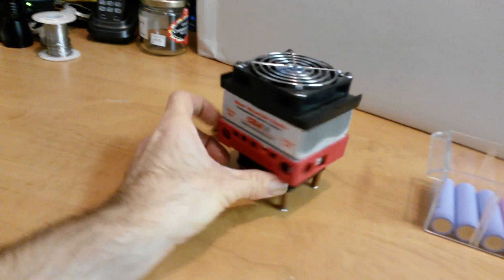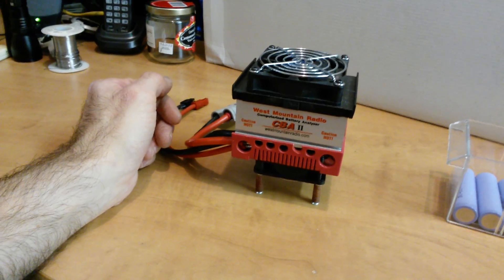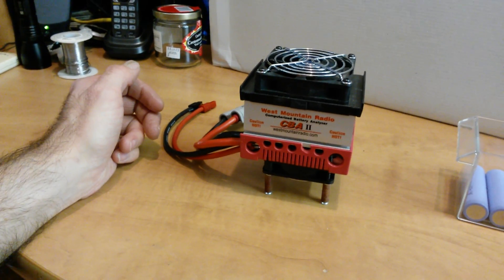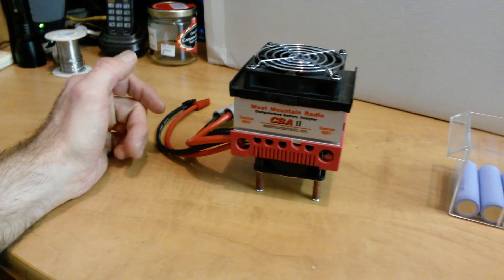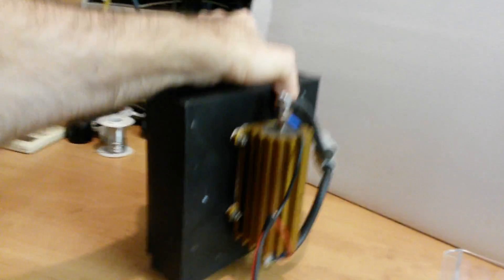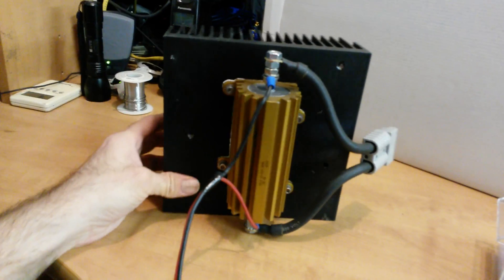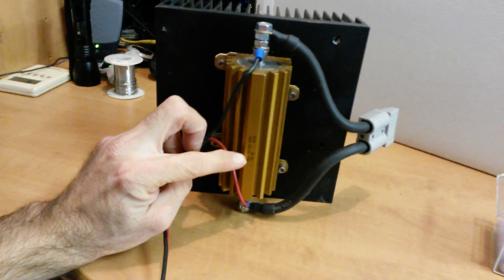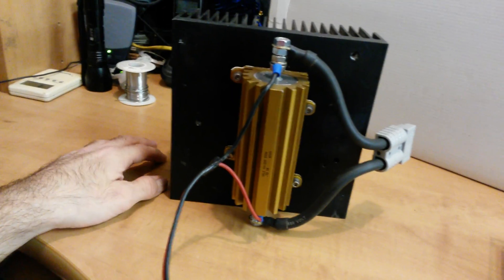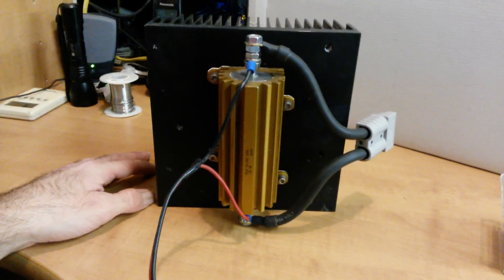You can also buy this big battery discharger. It can go up to 140 watts, but I prefer to be conservative at 100 watts to not blow it. This one is modified. But when it comes to more power, you can also get some of these bigger resistors which are 250 watts. It's 0.1 ohm, so this one has been made for testing single cells at about 30 amps.